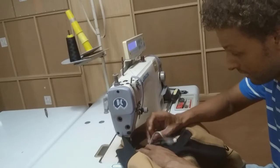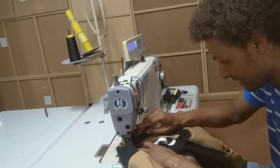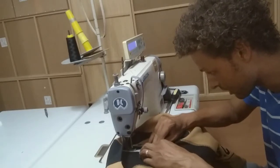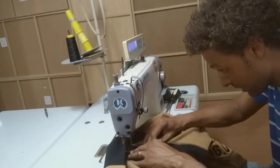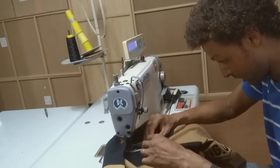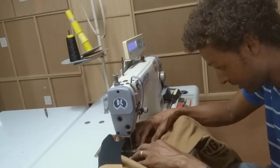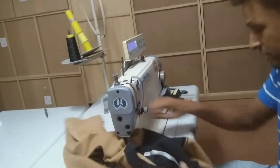This also has to be very clean because we want this to look as advanced as possible. We are doing name brand clothing here — not some flea market or supermarket clothing. We just want the best of the best. The distance here is 0.1. We can go a little bit faster with the machine because it's adjusted well. Again we have a contrast stitch — the tape is white, our stitching yarn is black. At the end we need to fold it to make sure the ends are not showing out. Always make sure you have enough bottom thread to avoid thread breaks.